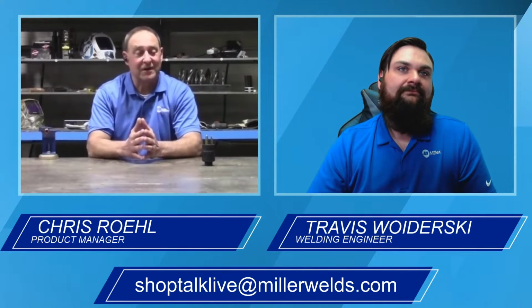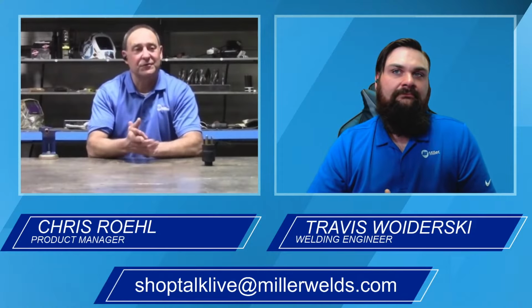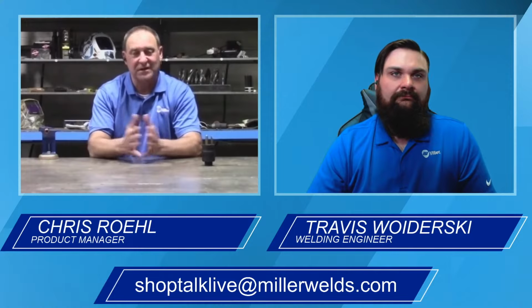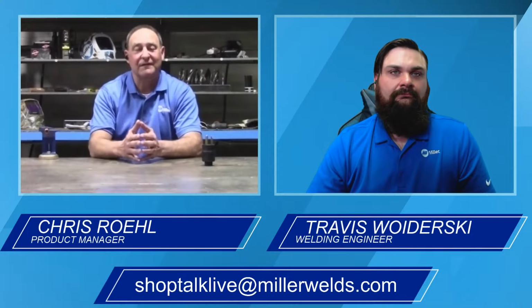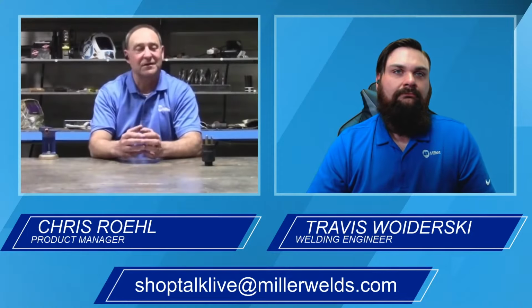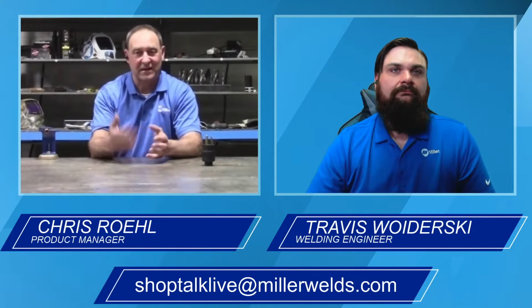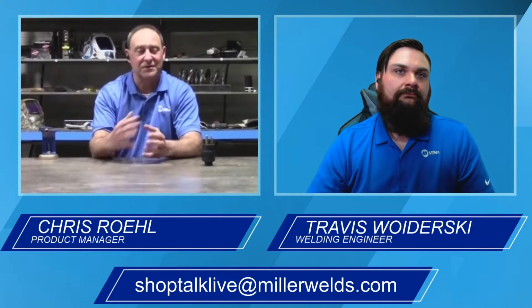I can answer that, Travis. We've been using LCD displays in our Multimatic machines since 2012, so about 9 years, and the LCD display has not been an issue. All of our machines that have LCD displays also have a lens over the front of it, kind of like a welding lens. So if grinding dust or spatter gets into the front of the machine, that lens is replaceable, so you can always continue to replace that.